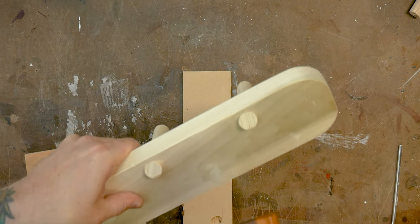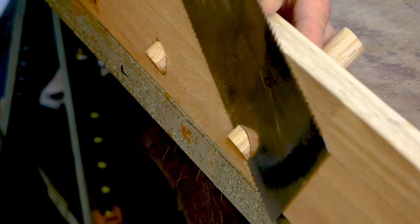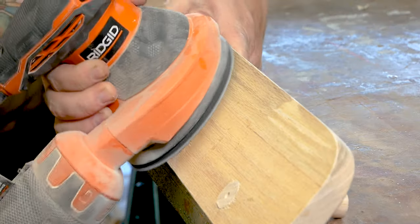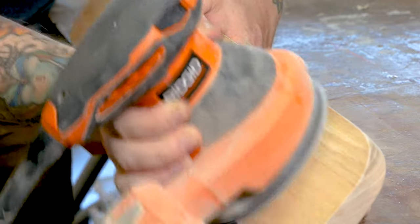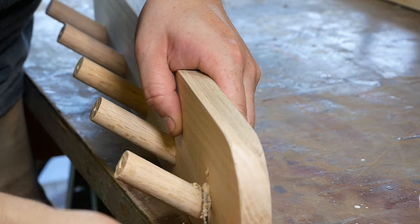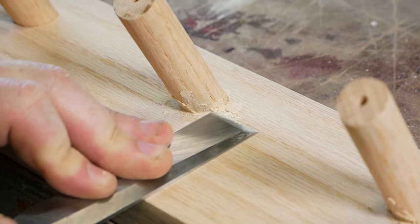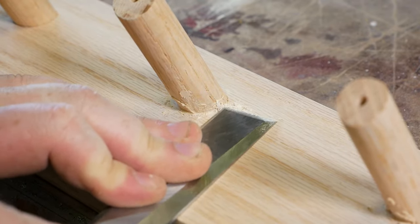I forgot about this and accidentally mushroomed two of the dowels. After the glue has dried, I flush cut the waste and sanded the back flat before filling any unwanted gaps with wood putty — or you could use glue and sawdust, your choice. A quick tip to make cleaning up your fill job easier is to use a chisel to do the majority of the work before sanding away the rest.